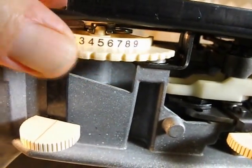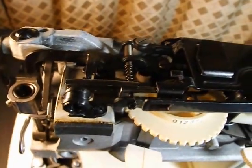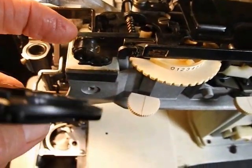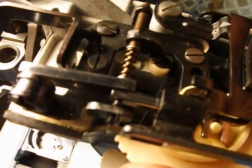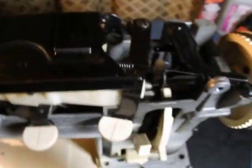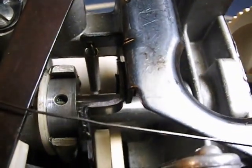You just turn this wheel to increase or decrease tension. The way that works: when you mount the tension unit up here, the pin that's inside the Singer type comes right through here and rests against this piece of metal. As you adjust the tension, that piece of metal goes in and out, and that's what puts more or less tension on there. You can also see the belt from the motor — it's a belt drive to the main shaft, which is a pretty thick, heavy-duty steel shaft.